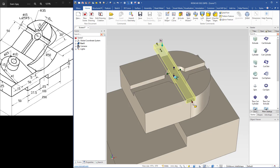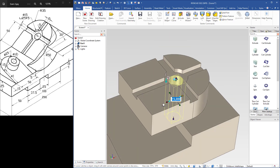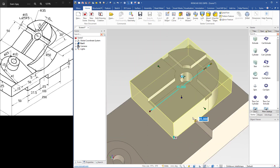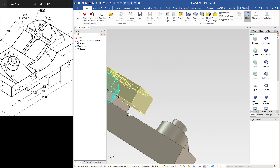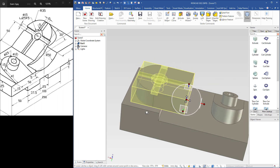Then I need to cut a hole in the center. I use a cut cylinder, drop it here. The diameter is 15 and the depth is 15. Now I have to move this feature. I select this block at IntelliShape level, shift-select the two cut extrudes and the hole in the center. I turn on the tri-ball, move the camera to this side, unlock the tri-ball, and move it to this point. Lock the tri-ball.